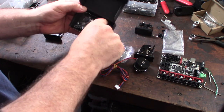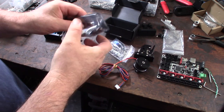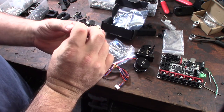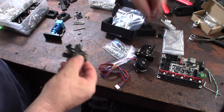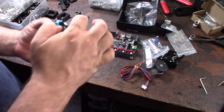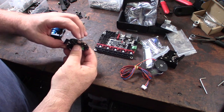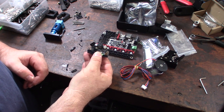I actually haven't installed these yet. I've seen them for about a year. It's basically like a CAN bus board — you can either do CAN or USB. You have four pins: power and CAN. So you can wire it back to your main board right there and run a CAN adapter off the board, or you can run the USB straight into the Raspberry Pi.